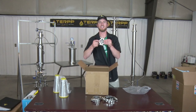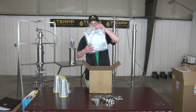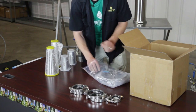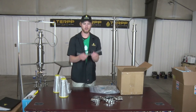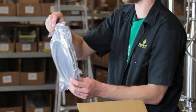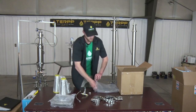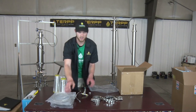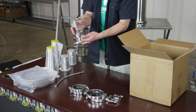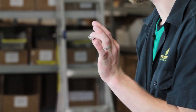Our two inch clamp should have two screen gaskets for holding our material inside our column and reducers. We should also have our hose set. If you purchased a hose set, it will contain a total of four hoses: a one foot or 18 inch hose, a three-eighths inch six foot hose, and two quarter inch six foot SAE hoses. Inside the bag should also contain a three-way inline vacuum valve and our reducer fitting for SAE three-eighths hose.